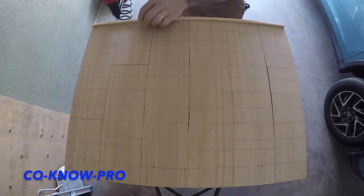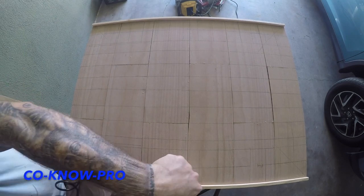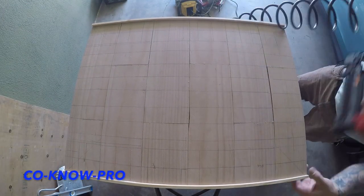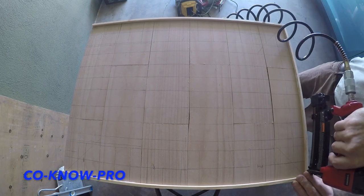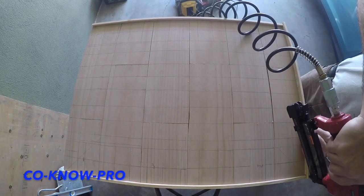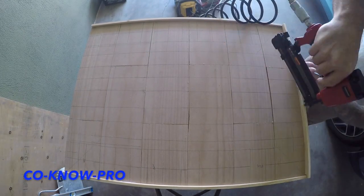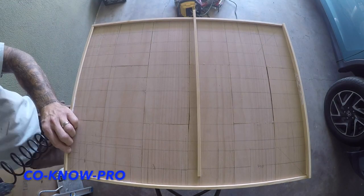Now we're basically installing our parapets. It's going to be a framing member and you can just frame a little pony wall as well, but sometimes it's easier just to lay a couple two by fours on top of each other. So depending on how long your slope is, that'll be how high you'll have to go up on your vertical parapet walls, which is the outer wall on the top of your fascia. And then you can run your 2% slope for all your drainage.